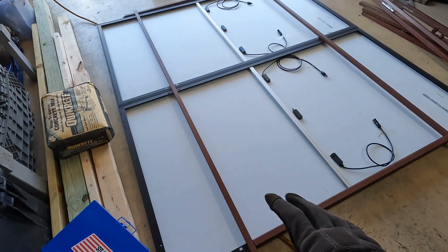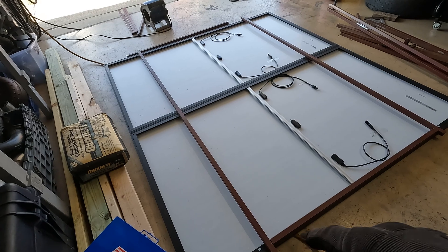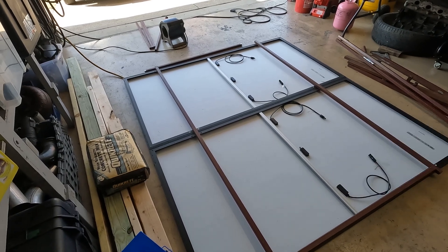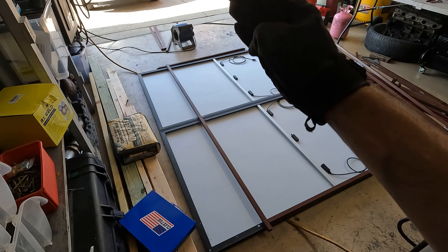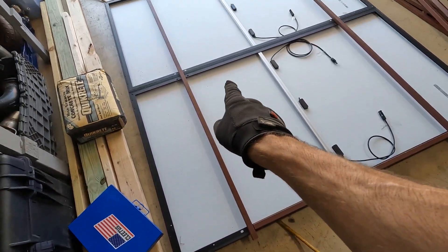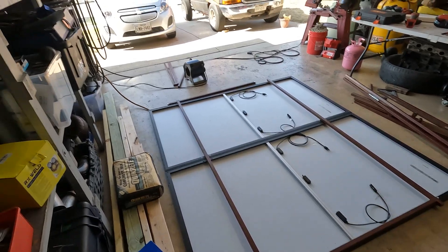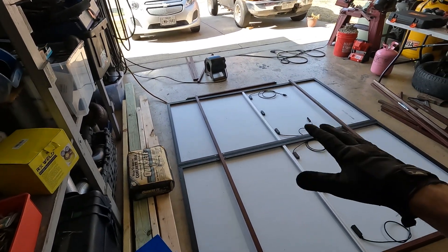The basis of our stand is going to be some 14-gauge one-inch square tubing. I chose this because it's about a dollar fifty a foot — not extremely expensive — and it's also very strong. To start, I laid two panels down and put a bar across where the mounting holes are so I can add bracketry to hold them down. Then I cut two more pieces to connect them and make a box. I also already made the legs, so essentially we're going to make something like a table.